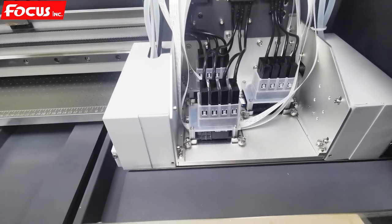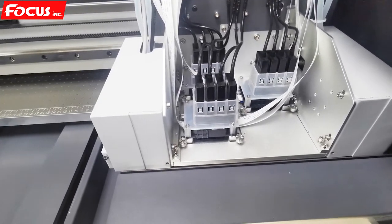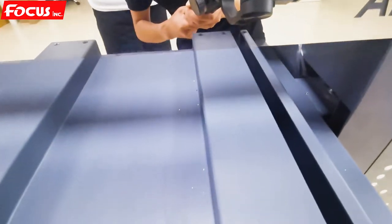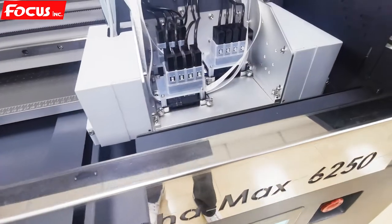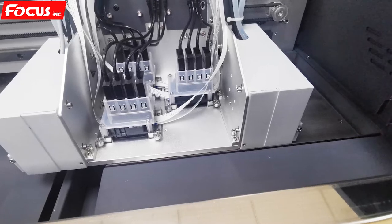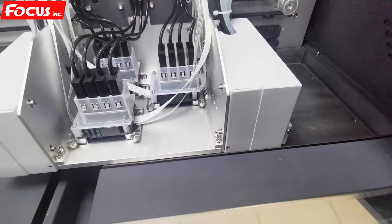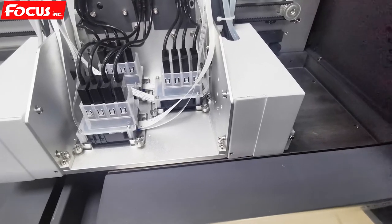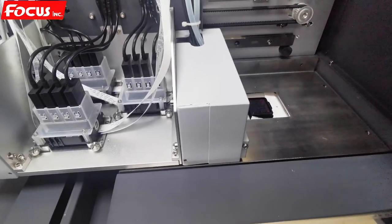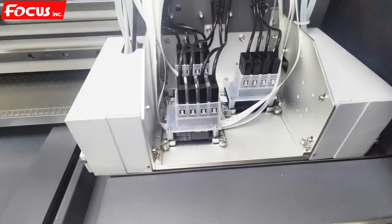Then the cap station moves up, then the pump moves down and pumps out the waste ink. Then the cartridge moves out and the wiper starts working to wipe the waste ink out. The Alpha Max combined with the industrial ball screw motion for the cap station provides high precision alignment, so we can get the best pump and cleaning results. This is unique — the first technology with automatic up-down high precision four ball screw motion.